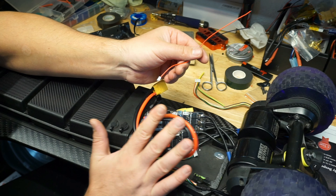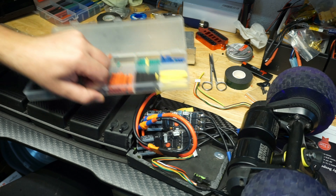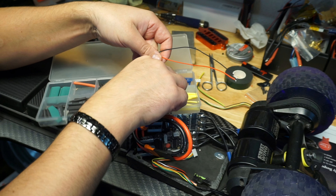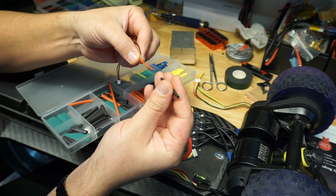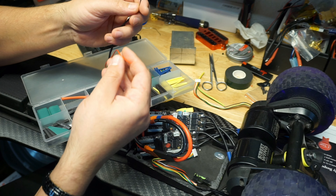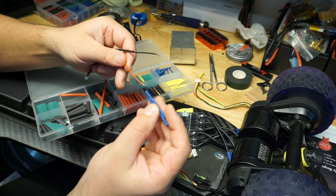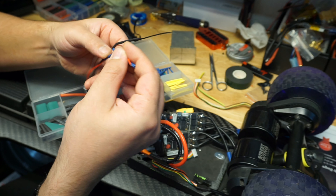Because it is connected to your board and to your battery, it could short out. So what I'm going to do before I install these cables inside my enclosure — very simple solution — a cheap set of heat shrink tube. I'm adding a bit more protection on these cables, giving them another skin. I don't have any red, so I'll put some blue — doesn't really matter.